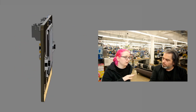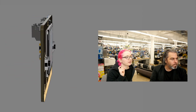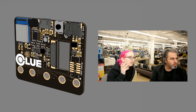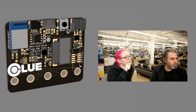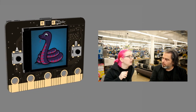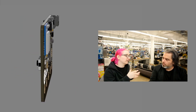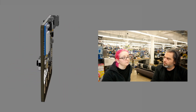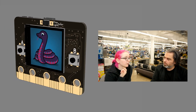On the bottom there are three capacitive touch pads, just like the micro:bit — same pin-out. It's got the nRF52840 module and two megabytes of QSPI flash. We had a little space so we put a STEMMA QT connector, so there are some sensors we didn't fit on — for example PM2.5, which is a particle/air quality sensor. Those are the size of this board, but you can just plug them in.